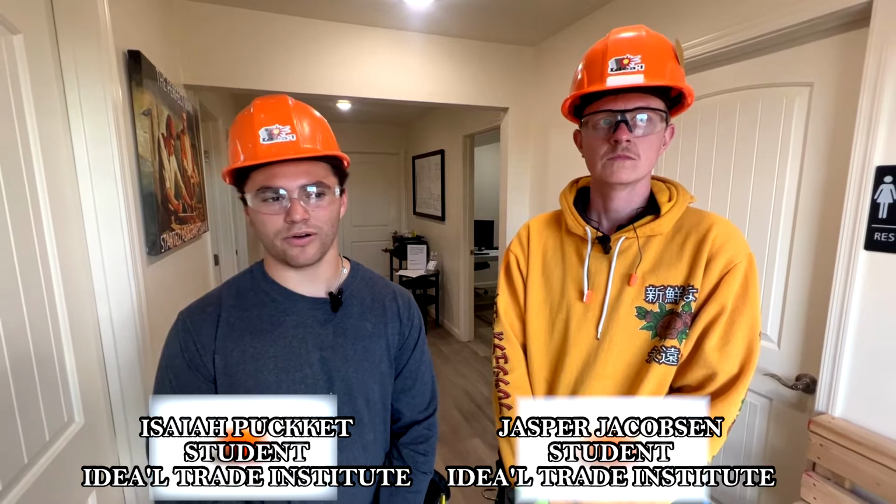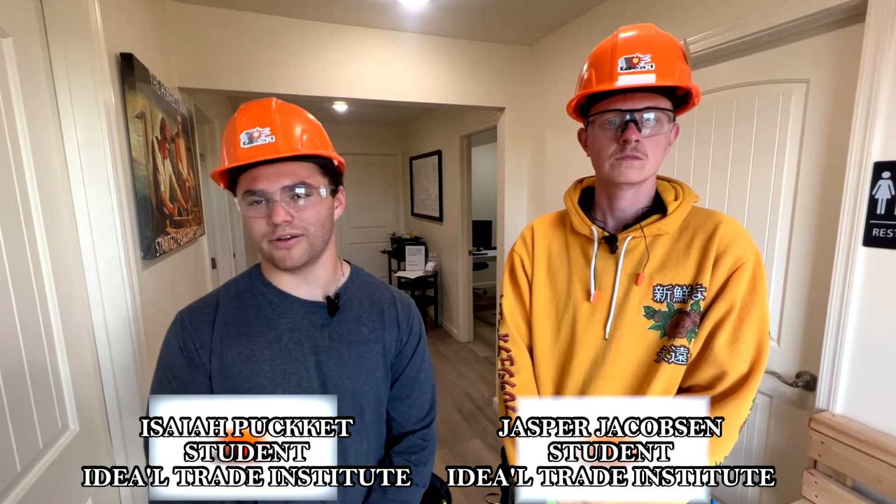Today we wrapped our house in Tyvek. We put our grounding strip on. We had put both of our windows in. We started our sliding door. We figured out where our junction box is going to go, and we put blocking in for our shower fan.